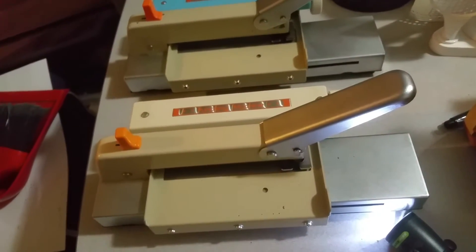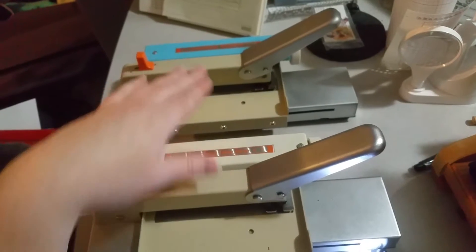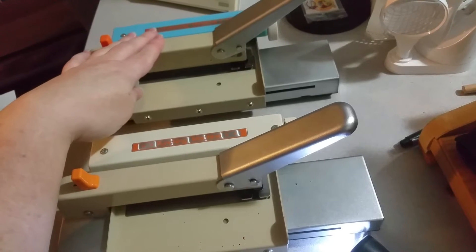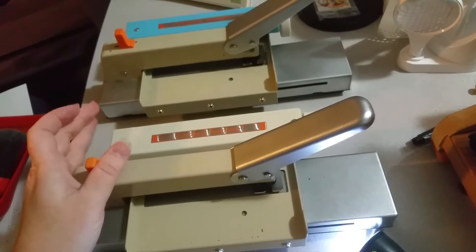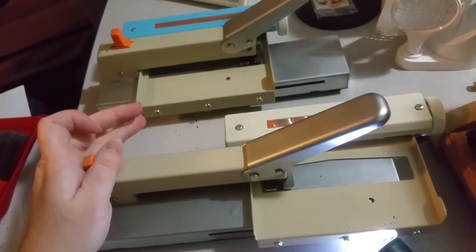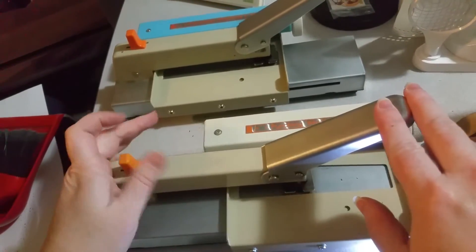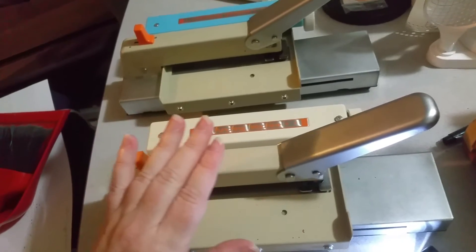I'm going to do a small video on the PM10 and the PM10F, which are automatic punching machines for the standard gauge punch card machines and the fine gauge punch card machines. Fine gauge has a 30 stitch repeat and the standard gauge has the 24 stitch repeat. By repeat, I mean it will actually advance across the card — either by moving it or when you punch it, it will also move. So you can punch and move blank spaces interspersed across a card. It's actually incredibly useful.